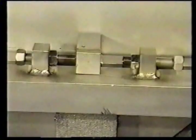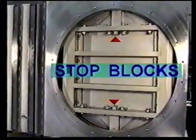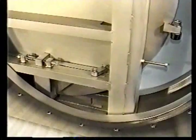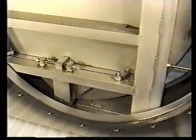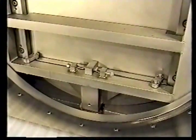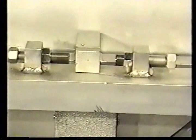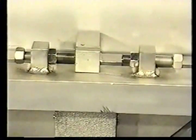The cylinder stroke should be long enough to push the carriage against the stop blocks. The stop blocks stop the forward motion of the carriage. If the stop block adjustment is too long, the links will be behind center. If the adjustment is too short, the links will be beyond center. The positioning of the link relative to the stop blocks is critical to the locking feature of the GNB valve.